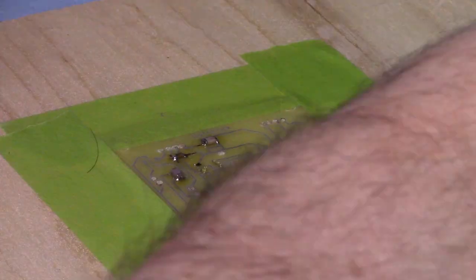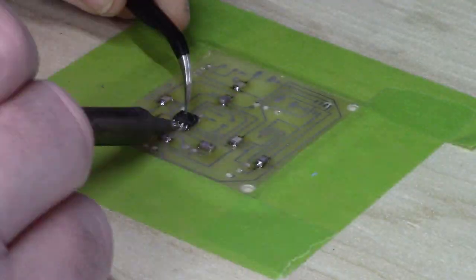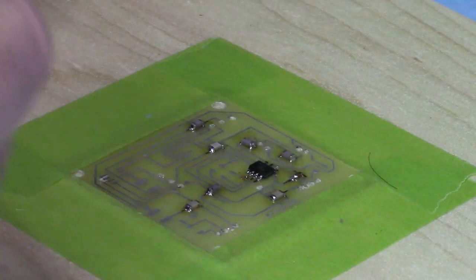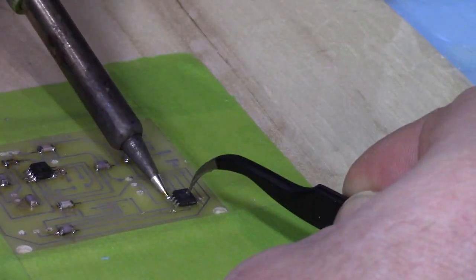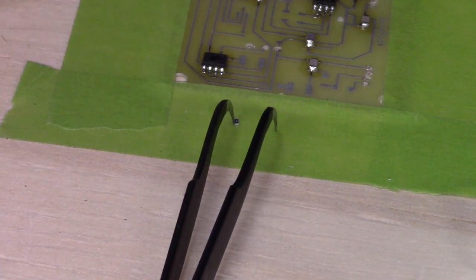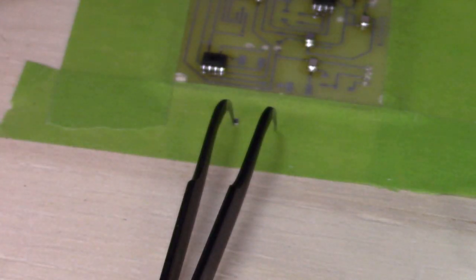It's fairly easy to make a mistake when picking out your SMD components. Once this LM555 is down, I have to do my first bodge. In this case I use two very small jumpers to hook up pin 6 to pin 7, and then pin 7 over to the output. I've got my zero ohm jumper out - my part, if you can spot it, is right there. Itty bitty little small thing. So cute, as my daughter used to say.